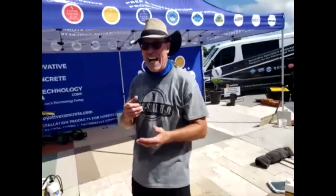That's an overview on concrete. Roof tile — usually the prep on that is to remove mold and algae. Soft wash. Do not hard pressure wash. You don't want to ruin or hurt the roof tile. Always soft wash those substrates.